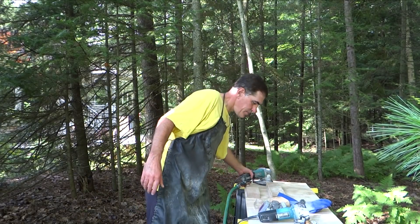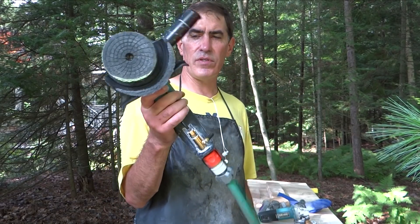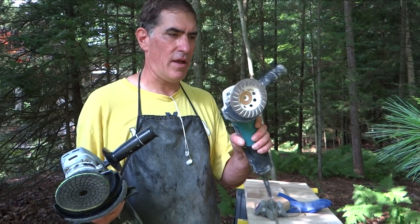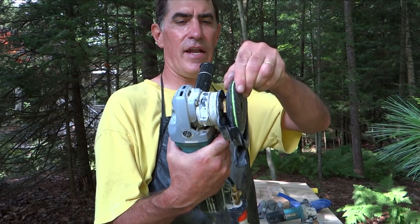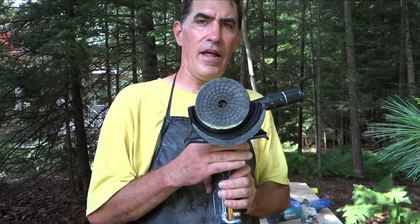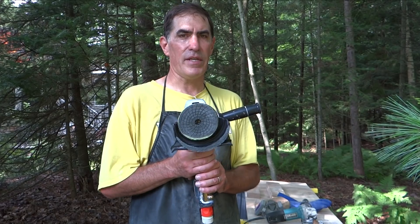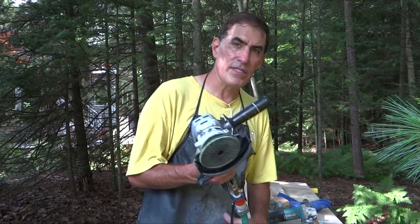After I use that, the next thing I'll use is this — it has water hooked up. This is a much more expensive tool, like $300, while the dry grinder is about $60. This one has a flexible backing and I think that's 60 grit right there. So I'll probably hit it with that, and then go into the tumbler at 220 grit from that point on. I'm not going to go through all the steps manually — I'll save time by just throwing it in the tumbler later. So that's the plan, let's get started.